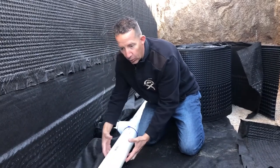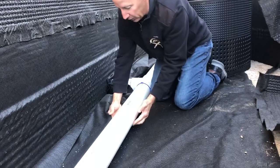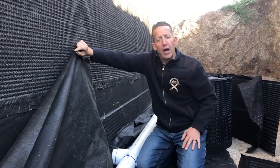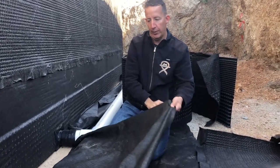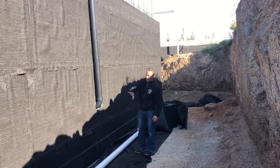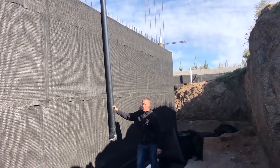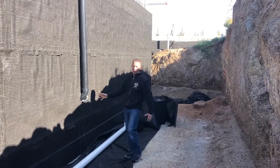This particular pipe has holes on both sides — the drain holes run along the bottom, two sets of holes. We've got filter fabric, and we're going to put one to two inch leach rock on top of this pipe, then wrap it like a burrito. We've got a 13-foot tall wall with a two-foot section, two four-foot sections, and then about a 16 or 18-inch section. We do have a penetration through this wall, which we'll use the 2200 joint filler around this pipe to make sure that it's sealed off on all sides.